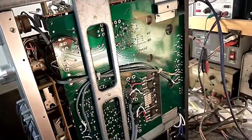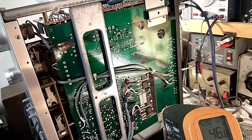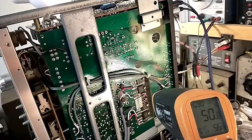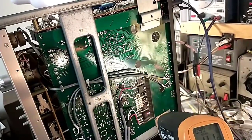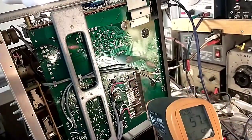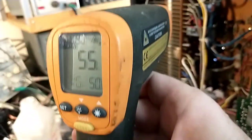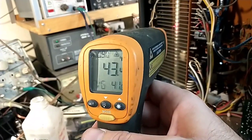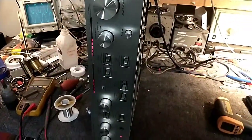So it did overheat. It's been off for a little bit and I'm just starting it to warm up again. We're like 57 degrees. That one sure isn't doing much — 57 degrees, 56. And that one's 43, 52. So the header here is really hot, but if we come over here, big difference in the fins. The heat pipe is a little better, but that's more than 10 degrees difference.